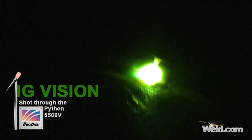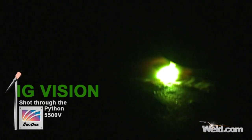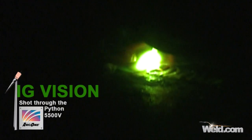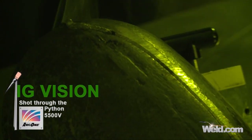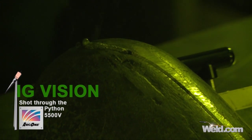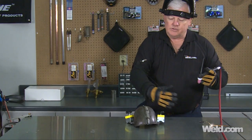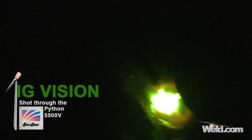Okay, I'm going to go to the top here so I can try to equalize a few of these stresses. Always add filler. You can tell this is cast iron just by how it melts — a little bit sluggish. You can see it's impregnated with oil, so I'm going to let this clean out just a little bit. It's cleaning out; it's actually welding up pretty nicely. I'm resuming the first weld — I'm going to skip around a little bit.